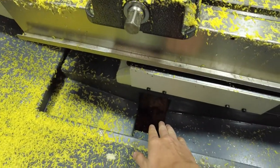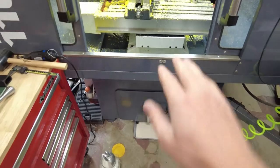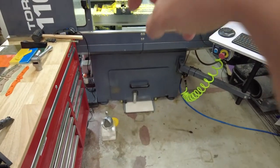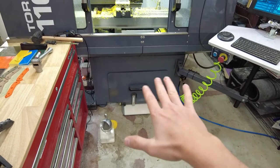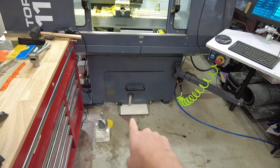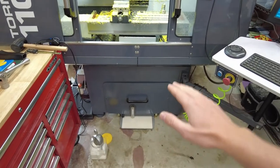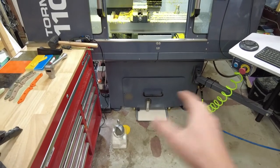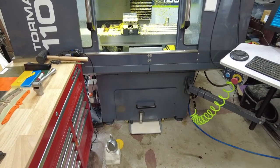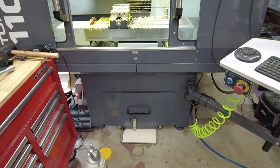There's a lot of chips — I need to clean it out. The coolant goes through a stainless steel mesh screen, and it's supposed to catch all the chips in that pan. Then there's a seven-gallon reservoir, at least for this machine, below that mesh. Big industrial machines are very different — they have augers and lots of different ways to do this — but that's how this one works.